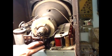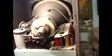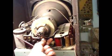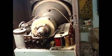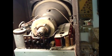Frame amplitude — that's picture height. And the frame sync — that's set so that the interlace is correct. It's difficult to explain, but basically the picture scans at 25 times a second, then it's infilled making 50 in all. If that control isn't set properly you get poor interlace — in fact you'd get something like a 202-line picture rather than 405. That's basically what it's for.